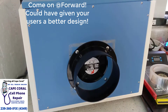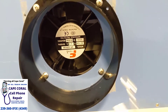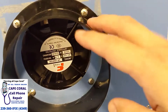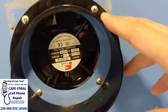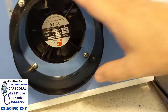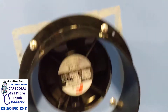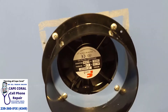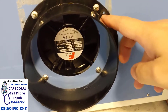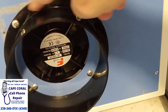I'm going to show you exactly how we get that done. The first thing I did was remove this because it was going to be in the way of the actual collar. Also, you don't really need it if you're going to have a duct in here — it's not going to be a safety issue. The four screws that you see there were holding this bracket, but they're also the four screws holding the fan on the inside, so they have to be there. I aligned them so that the top of the collar would just hit those screws.